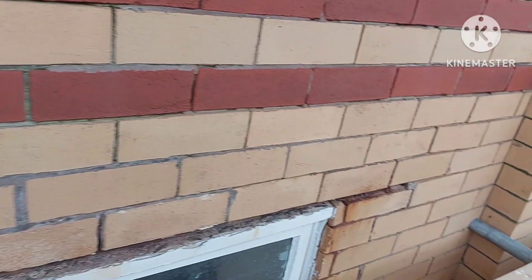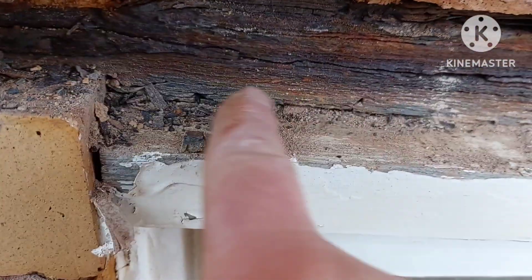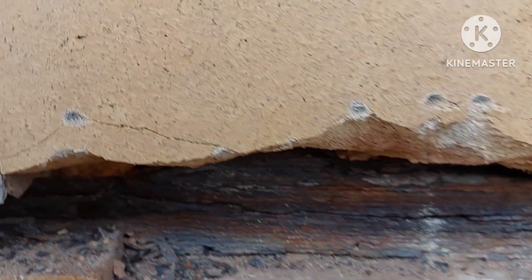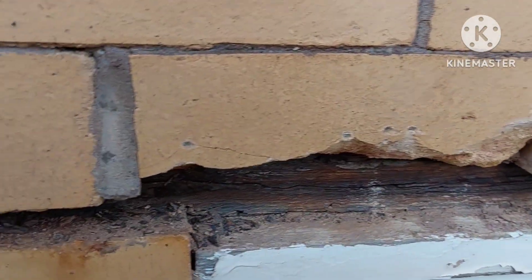It's Monday and Monday's project is putting a lintel into this. This wall was put up in 1894. And that bit inside there is what's left of a steel angle iron. It's expanded and expanded and expanded until it's opened up the building. So our task is to take it out - we have propped it this time - and replace it with a concrete lintel.